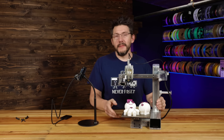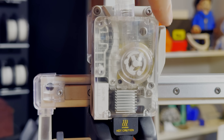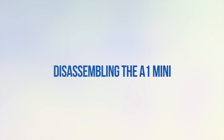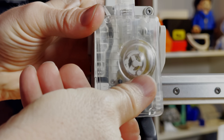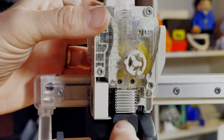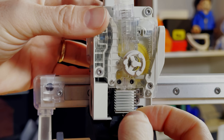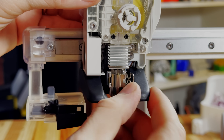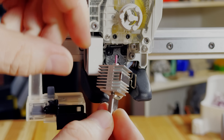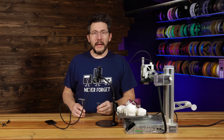The transparent case helped a great deal. The prints are staying on the bed and we're not going to look at them until we're done. What you're looking at right here is the clear case. I'm surprised the cutter lever isn't clear, but most of it is. The first step is taking off this clear case — it just pops right off. Below is the nozzle, and there's this little gate that pops open; then the entire nozzle assembly can come out. You can see where it's held on — there are magnets and a thermistor right there.